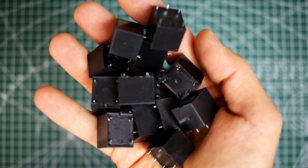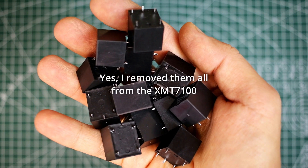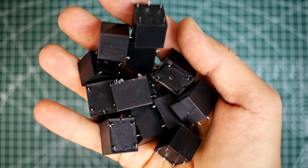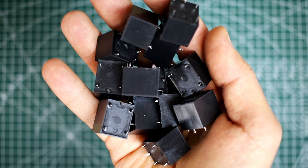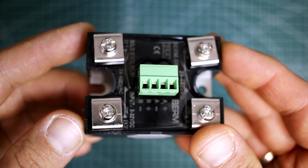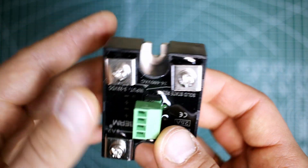The answer is very simple: I don't trust mechanical relays. A mechanical relay can weld on the contacts and burn the heaters in the gadget. The SSR relay has the advantage that it does not weld on the contact. So we know SSR relays are better.